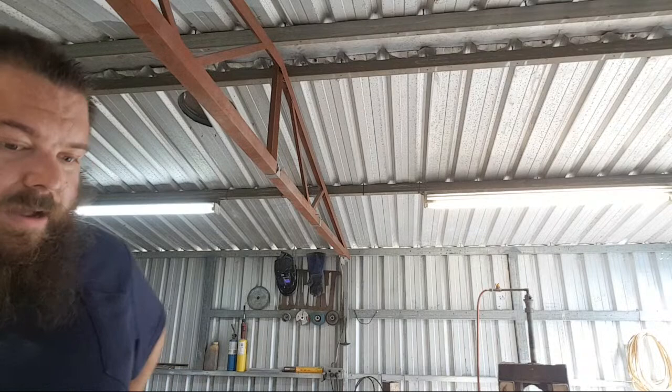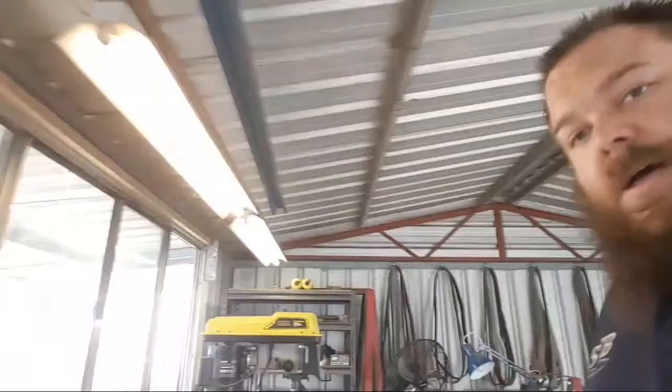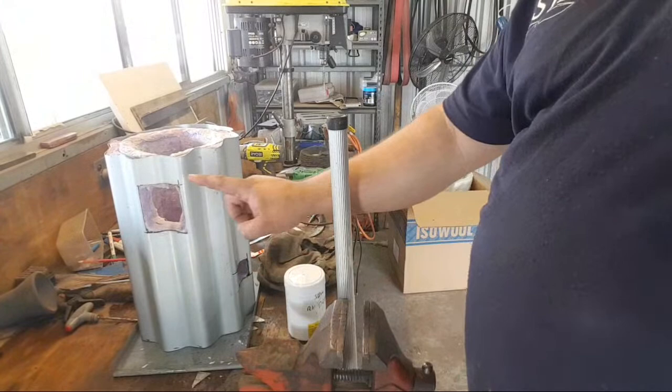Yeah, sorry, Paul, I wasn't answering your question because I was kind of in the middle of something. The advantage of a post-box forge is that you have indirect heat at all times. So there is no direct flame on your work, which means that there is no hotspot. The other advantage is, because you're heating a secondary position inside the forge, just to give you reference, there's the burner hole, and here is the forge entrance.